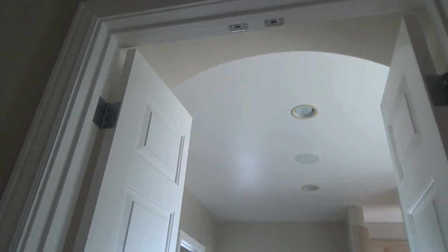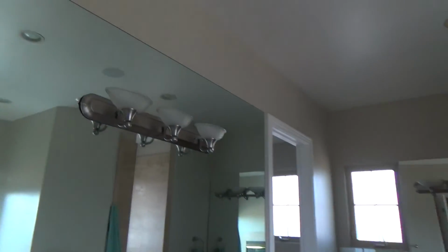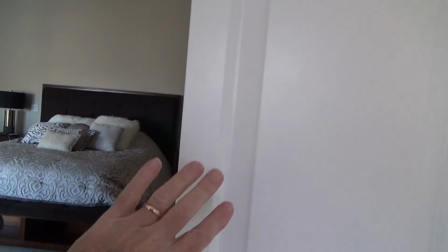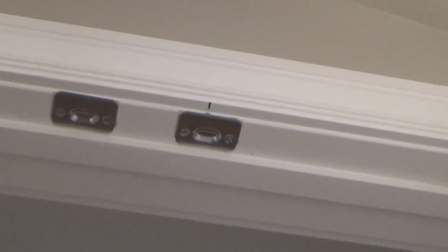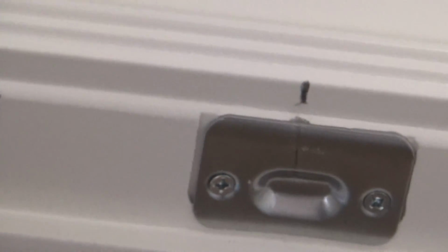Before I get the ladder, let me show you. These are the doors that I fixed before, and I've got that video on my channel. Remember, before, this door was really hard to close and to open. That meant that ball bearing catch, that little spring-loaded deal up on top of here, was up too high. And son of a gun, look at this. You see that mark right there? I'm trying to hold the camera, sorry. That mark is right where the ball bearing catch was hitting the bottom of the casing right there.